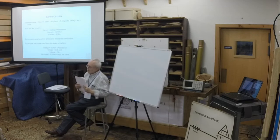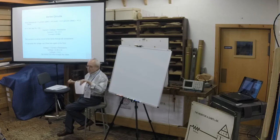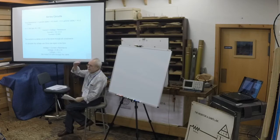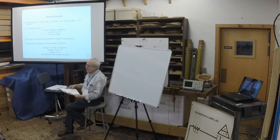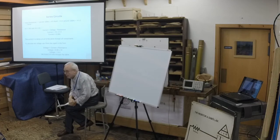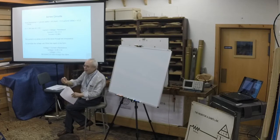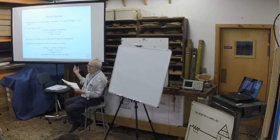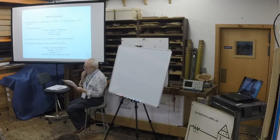So I went up to the attic and asked whoever was at the console just to go push a general on which everything was set and go between it and cancel. And I looked at the power supply and I read the voltage and it was going, not much change. Then I looked at the cable that ran down to the organ. It was a piece of Romex. And I felt it. And I shouted, "Stop!" because it was getting hot. And obviously, Mr. Hildebrand hadn't seen this.